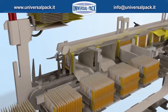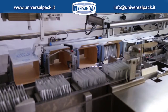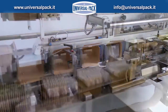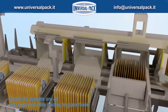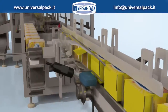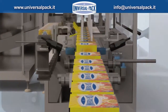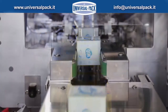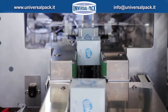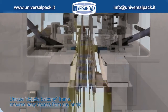The insertion arm is servo-driven and the sliding hopper permits the Delta 130 to securely feed stick packs or sachets into cartons. The unique double balcony frame of Delta 130 combines the simplicity of a GMP frame, ensuring accessibility to cartons crossing the machine with visibility from any angle.